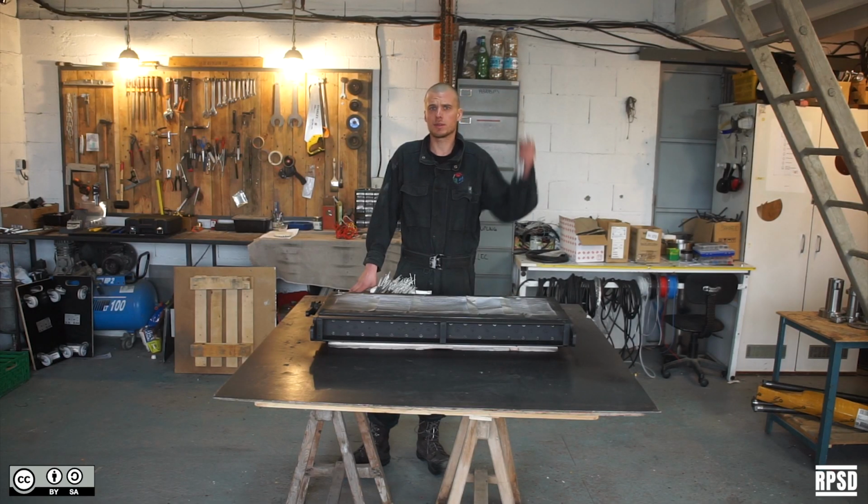Next, we're going to install the cartridge heaters into the holes in the edge of the aluminium. They're 380 volts, so you're going to wire each one between two of the phases. We're going to divide them evenly between the three phases, so 2 groups of 21 and 1 group of 22. You can color code each of the holes with a marker so it's very clear.